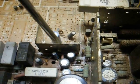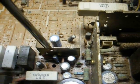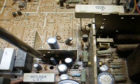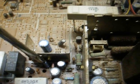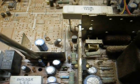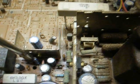Well, based on his complaint, this is the first area we need to look in, the vertical output stage. This is the IC on this heat sink that, like I said before, is prone to developing bad solder connections. And if I remember right, this capacitor here would fail at something like a 2.2 microfarad, but when it failed, it would cause vertical linearity problems. Looks like this one might have already been replaced at some point.